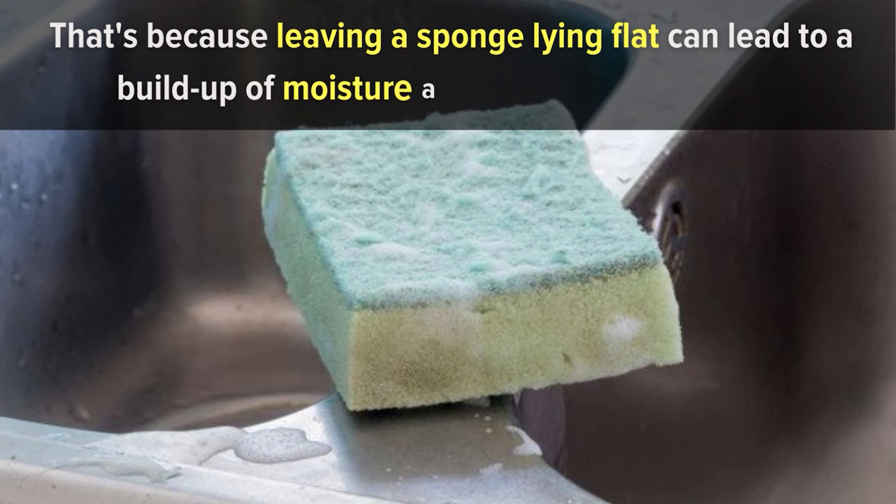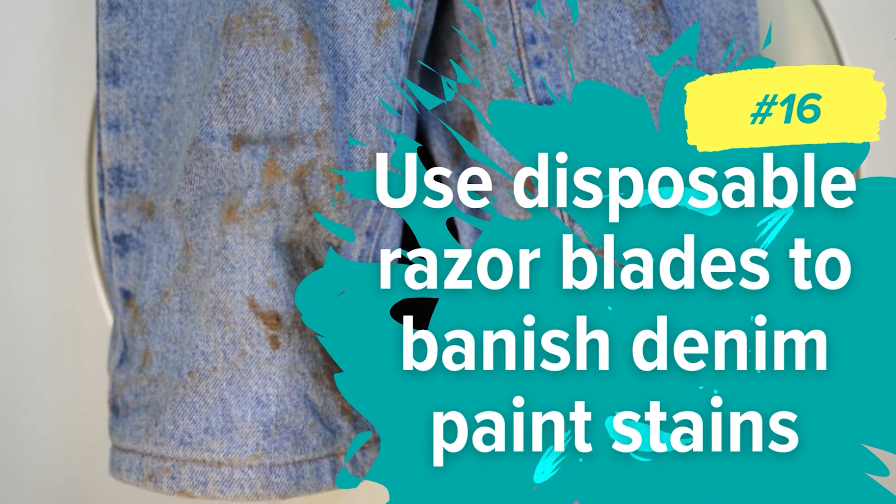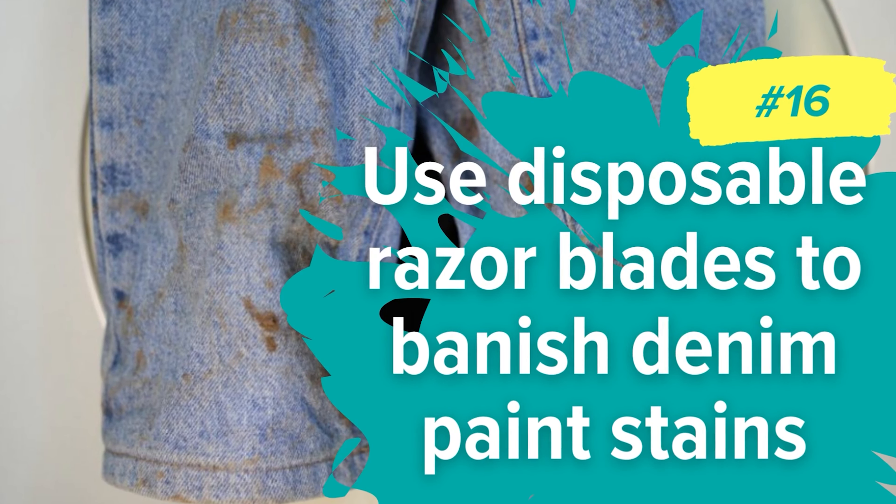Number 15: How to make your shower head shine again. A dirty shower head can reduce water flow and spoil the overall look of your bathroom. Here's a simple and highly effective method: combine one cup of white vinegar, three-quarters cup of baking soda, and enough water to create a thick solution. Pour the mixture into a plastic bag, then carefully tie it around the shower head, making sure the shower head is fully immersed. Let the bag sit there for 12 hours — overnight works great. During this time, the vinegar and baking soda will work their magic, dissolving the buildup of minerals and grime.